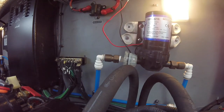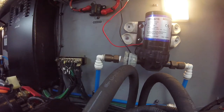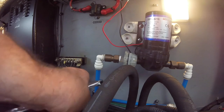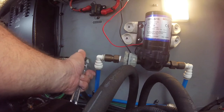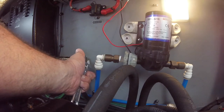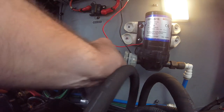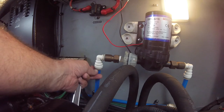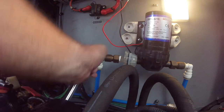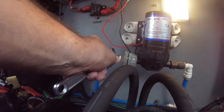It's such a tight space I had to bring the GoPro down here. Plumbing on most boats looks like something you can buy at Home Depot, but technically it's 15 millimeter — European-style plumbing. I've only been able to find this size at boat stores, but it's probably available as special order on Amazon. For these push fittings, you push up on the fitting and squeeze a little grey clip to release the plastic pipe. I'm going to start right here and take this off.